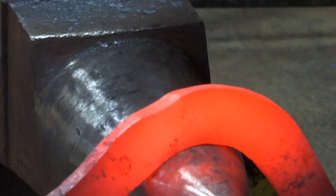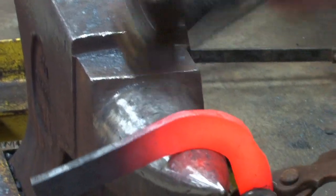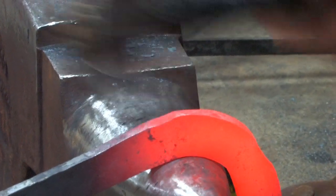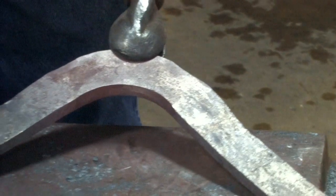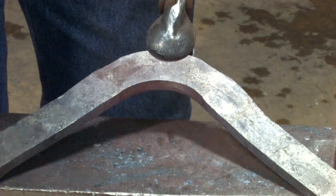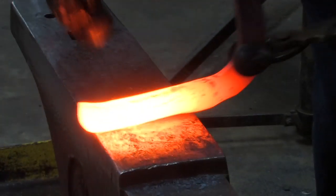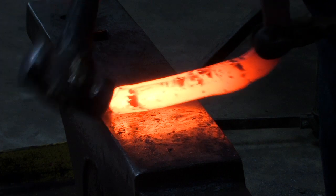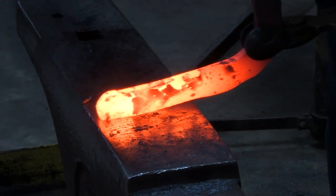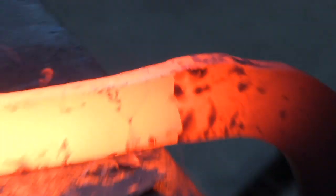Set my Masselots slightly to the side and turn it. Now we can see I've got more material each side of the toe for my Masselots, for my clips. Outside heels, we want to keep it blocky, so I'll just forge the outside edge over the horn, knock it back into itself, make a nice heel shape, and clean it up behind the Masselot.